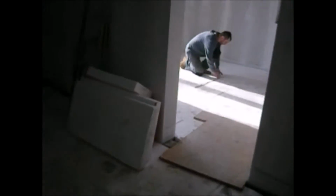Now I will show you a small bathroom. A few days ago we've done hot and cold water pipes in this bathroom and outlet pipes. We also prepared pipes for the gas boiler, and under the gas boiler we've put manifold and main cold water valve and meter. It will be covered by plasterboard together with the toilet flusher. But let's have a look how to prepare the floor for the floor heating system now.